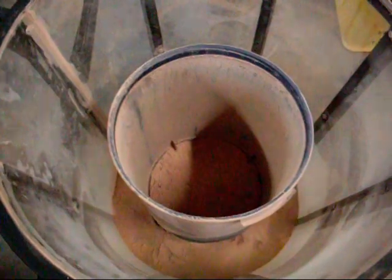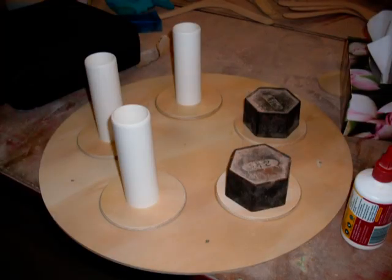After doing a bit of sanding and testing the new seal, it appears to have sealed quite nicely all the way around the bin. There's quite a lot of fine sanding dust collected in there, and amazingly quite a lot of fine dust has also stayed on the outside. Looking at the top outlet pipe, there appears to be a lot less dust in there, so that's obviously stopped the problem with dust bypassing the cyclones. The new seal worked quite well.